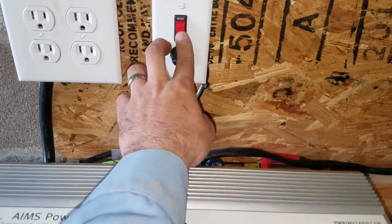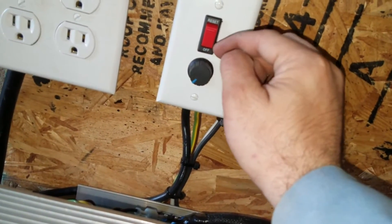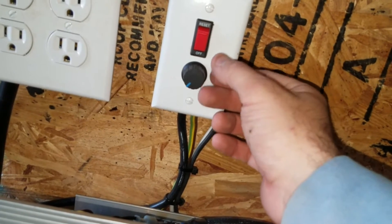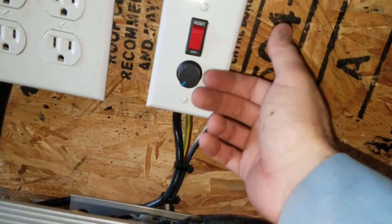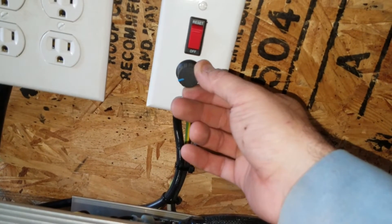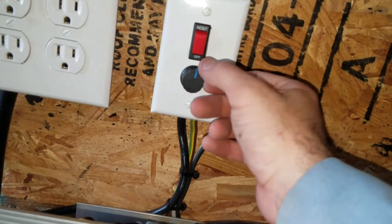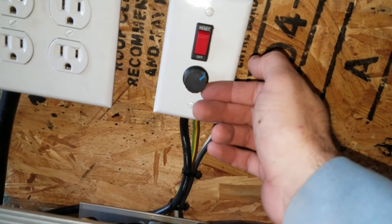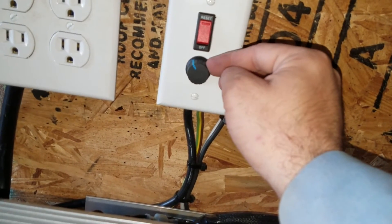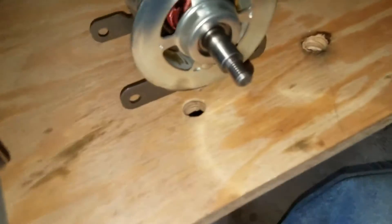It's working good. Let me explain a little bit about this potentiometer — I use a 100K potentiometer. Why 100K? Because the controller is better controlled with it. You can use 10K, 20K, 50K, or 5K, but the difference is you don't have as much fine speed control. Right there in the center it doesn't work, so I have to push a little bit more. Right there in the center — that's the lowest speed, the minimum speed.